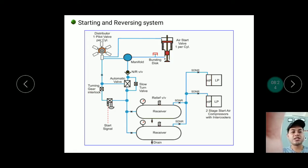When you press the start signal, air flows into the distributor and into the manifold toward the valves, but cannot exit yet because the valves are closed. Then whichever cylinder is on the power stroke — for example cylinder number 5 — receives pilot air from the distributor, which pushes the air starting valve open. The 30 bar pressure from the manifold then enters that cylinder and pushes the piston down, turning the engine.